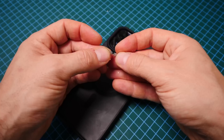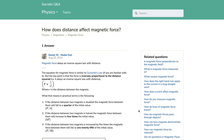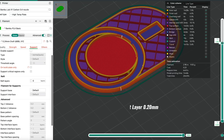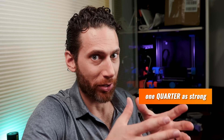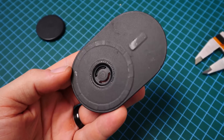Let's take a moment to talk about magnetism as a whole and how it works. We all know that magnets have a polarity - a side that attracts and a side that repels. But did you know that a magnet's strength decreases exponentially as it gets further away from another magnet? This means that the difference between laying down a single 0.15 millimeter layer before inserting the magnets versus two layers at 0.3 millimeters total height is not half as strong - it's actually a quarter as strong. Which probably explains why the folks who make the original popsocket opted for such a thin piece of rubber to hold their magnets in.